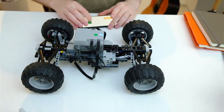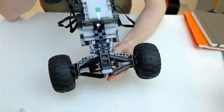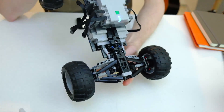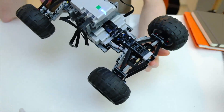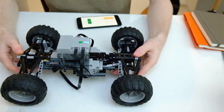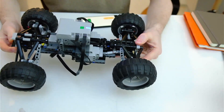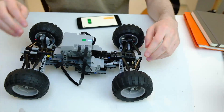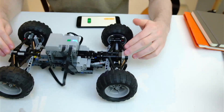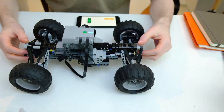...compress or uncompress when it's moving backwards and forwards. That's because when these gears rotate and mesh, rotating one way is actually pushing the gear next to it up or down, and that translates into a rotational movement. But if that gear can actually move up or down, it will — so if you imagine the gears on a lever, it's going to rotate the lever too. That's kind of what's just happening here — it's pushing it up, which moves the back of the car down like that. It's a funny thing to watch, but it's way too much movement and not something you'd generally want.